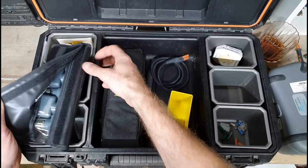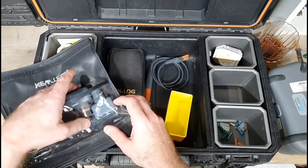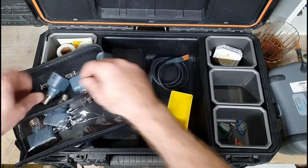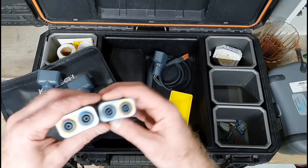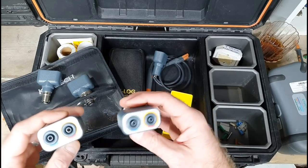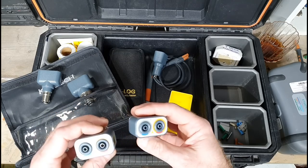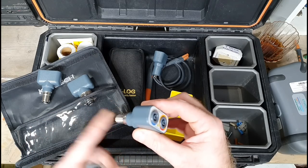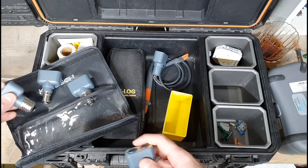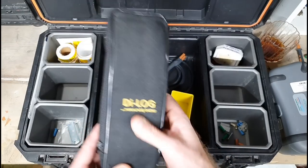In this little pouch we've got the Light Mate kit. In here there are Edison screw, small bayonet cap, small Edison screw, bayonet cap, and a GU10. You can plug your leads in there, prove polarity live, do a Zs — and continuity dead if you wanted. On a Class 1 light fitting you've got your line, neutral, and you can croc clip onto the CPC at the earth terminal.